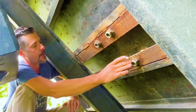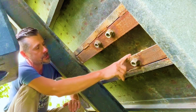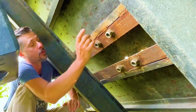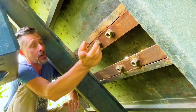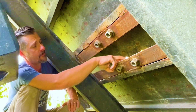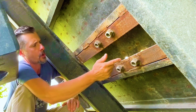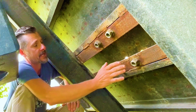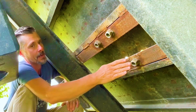Lining all these holes up is kind of a bear. What I did is I made the holes a little bit bigger than the holes in the top because I wanted to get my bolts exactly square. I sat the plate up there, put the bolts through the plate, then tightened up these nuts — and because I'd made the hole a little bit larger, I just tacked the nuts and washer off where they go. I thought about putting a reinforcement sleeve, but there wasn't that much flex because of the wall of this angle and the fact that the bolts keep the nut plumb and true anyway — because they're big bolts.